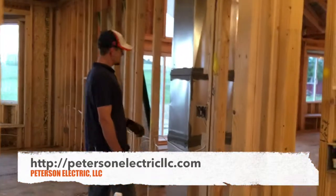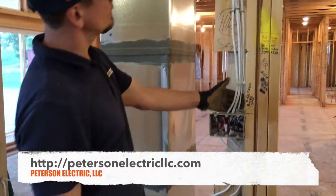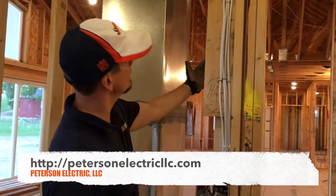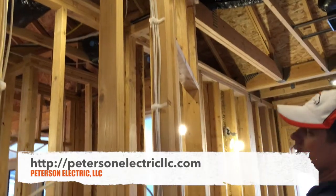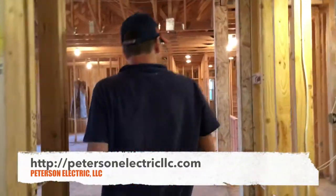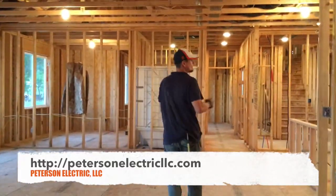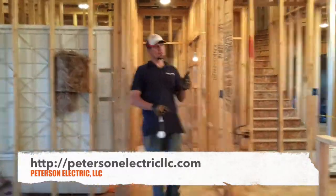The other thing I do is stacks — I like to do these wire stacks like a lot of electricians are doing nowadays. These are really nice. We used to have to staple, which kind of turned out fine for the back side, but as you come up a wall the inspectors accept these now and actually prefer them. Don't forget your fire caulk in your holes penetrating between floor and ceiling.